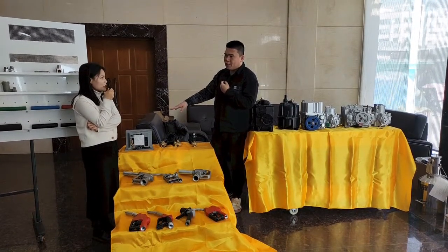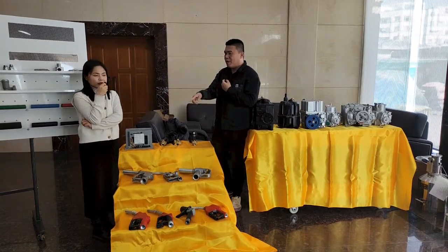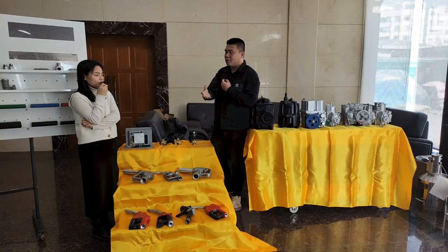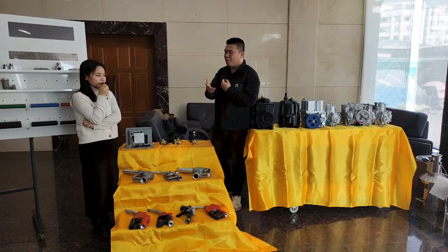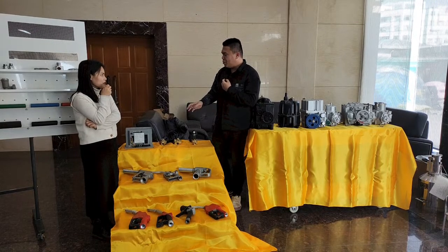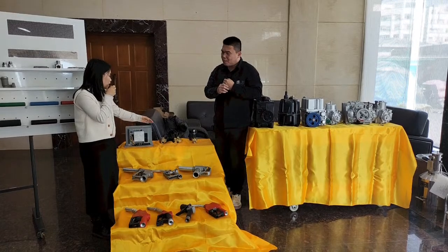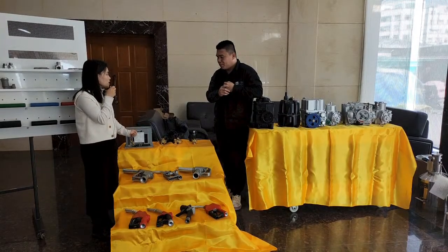The controller said the valve close is 0.5 liter, right? Yes. On 0.5 liter, the big valve closes. Okay, just the small valve open. Filling around 10 liters, the small valve closes. Why do it like this? They want to do the accuracy. Okay, so the valve is for the accuracy, right? Yes.